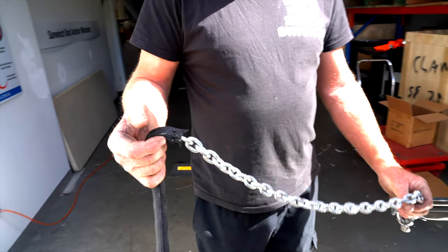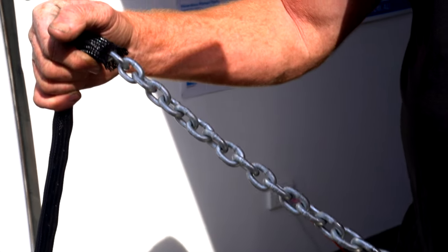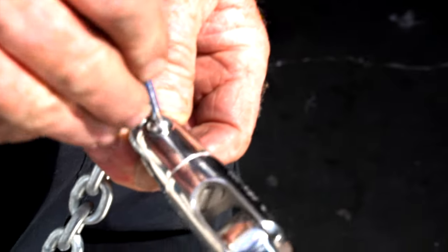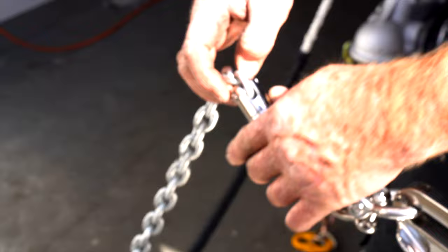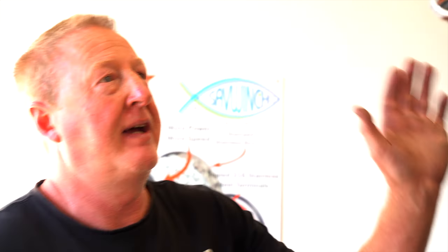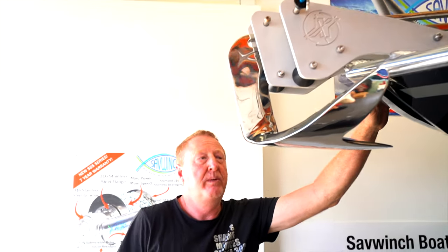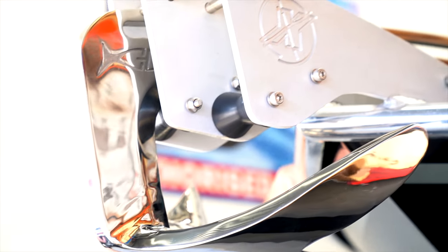When putting on the chain guard, we tend to leave the first little bit of chain exposed — that's a great indicator when you're bringing your anchor up correctly. We've attached the anchor through a D-shackle and then a swivel, using Loctite on all the connections so that it can't come undone. Here we have it — complete. Anchor running through the winch into the 1500 SSS, all concealed wiring, all integrated, now part of the boat. Ready to hit the water.